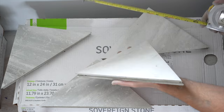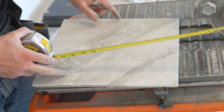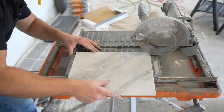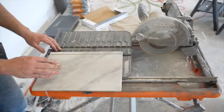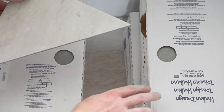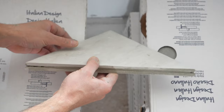I need to cut faces for each one of these shelves. I went ahead and cut this tile down to 13 and one-eighth, and now all I have to do is cut three-quarter inch strips off of it. If you're building a tiled shower I highly recommend investing in a wet saw — especially for ripping down pieces like this it's an invaluable tool. I also need to put a bevel on each end of the face, which I just freehand on the wet saw. Then I'll move somewhere I can set the tile shelf upright so I can work on the face without it lying flat.